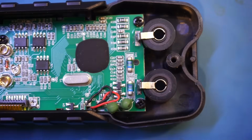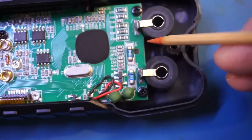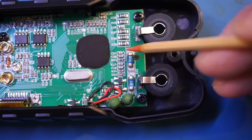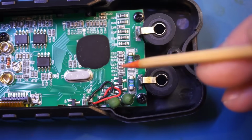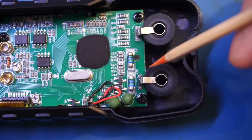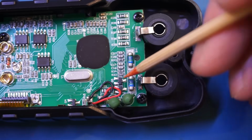Now, I do want to point out one thing here. You see that Zotac used 2 resistors in series for the input, and these 2 resistors share the input voltage. They are distributed evenly across, and this is actually a common practice. However, if you look carefully, the distance between this resistor and the input jack, by the way, this is a positive input, they are actually pretty close.